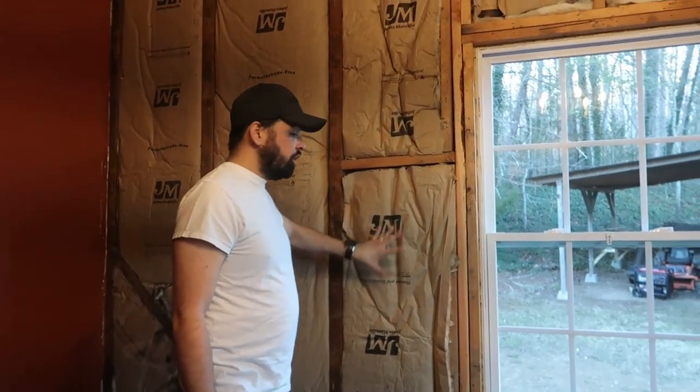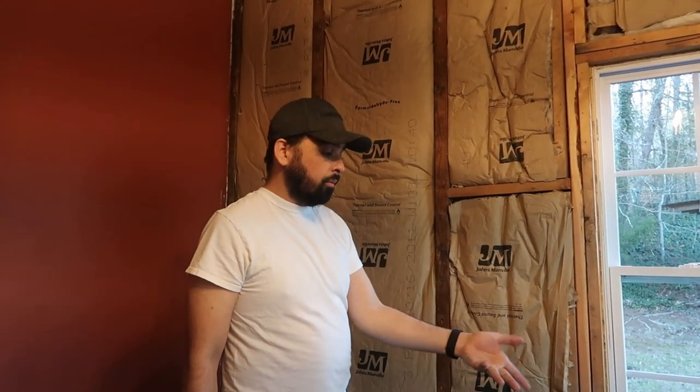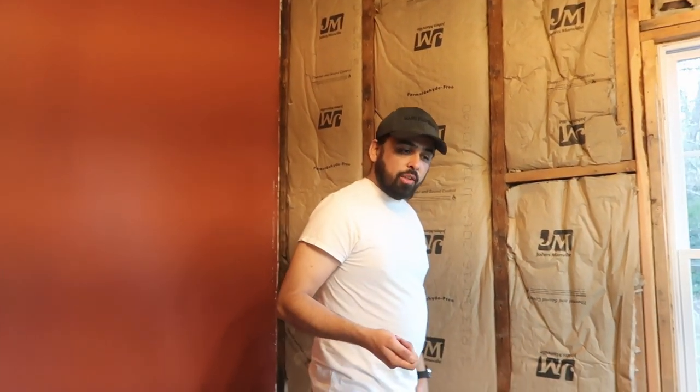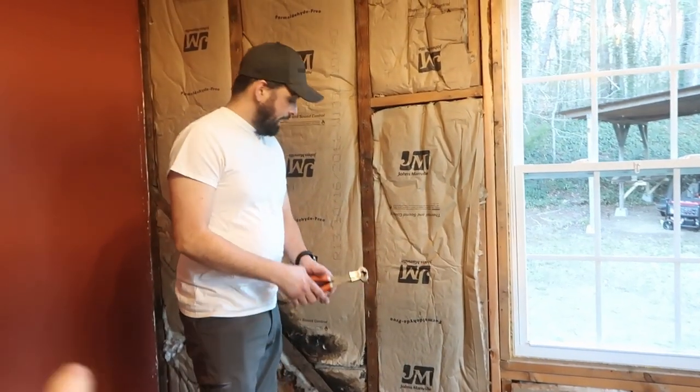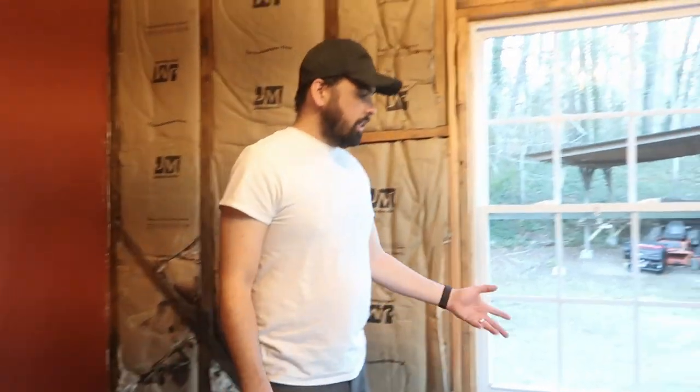It would be attached only to the sheetrock. Now these were strong enough, they work really well when they were attached to wood, because wood is really strong. But when you use sheetrock, if you're not careful with the way you plug things in and pull them out, eventually you can wiggle these boxes loose from sheetrock. So since now I have the opportunity to attach them properly to a stud, that way we avoid future problems of outlets getting displaced.